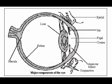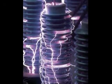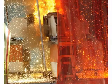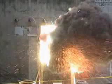Arcs can be very dangerous. They create very bright ultraviolet light that can burn the retina of the eye. Sometimes arcs create low-resistance paths for electricity to flow between electrical conductors such as wire. This can create an explosion of superheated gas called an arc blast. An arc blast can be a powerful and very hot explosion capable of killing or injuring anyone nearby. Here is a clip of an arc blast created on purpose by shorting some high-current 480-volt AC wires.